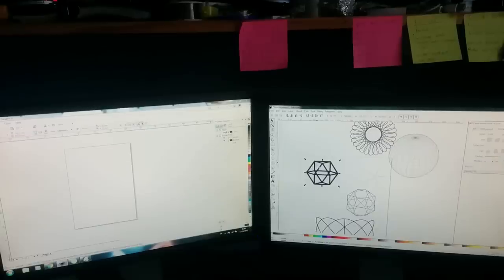The software that comes with the laser cutter - you have two options. One is called Laser DRW and the other one is called Corel Laser. They're both pretty similar and might be based off the same program, but I found that Laser DRW can't accept as many file formats to import into it. Whereas the CorelDraw laser plugin that you get is pretty flexible - it accepts loads of different formats. So I recommend using the CorelDraw plugin if you have access to it.